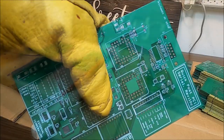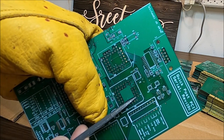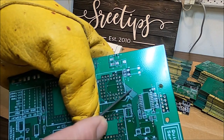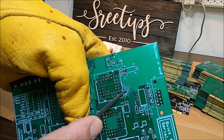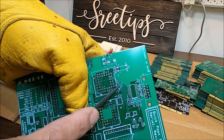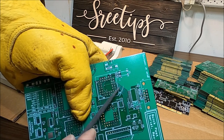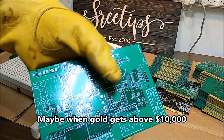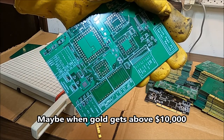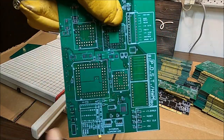From the circuit card fingers — this camera doesn't do close-ups very well. But I think all these little circles on here for the chips to be set in might be gold. I scraped a file across the tracks there and I looked at it with a magnifier. The GoPro doesn't give a good close-up so you can't see it, but there's pink metal underneath where I scraped the solder mask off. What that tells me is these are little trails of copper, not gold. So there's very little, if any, yield even if we could get the gold off of these little circles, for the amount of work we'd have to spend to get the gold recovered off of here.